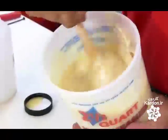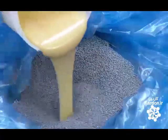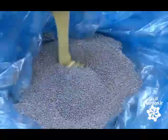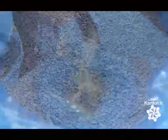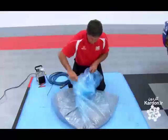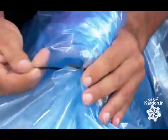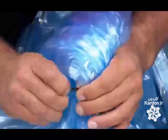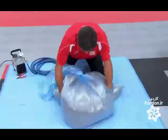To make the seat, they first have to produce a template, which is in itself a two-day process. Technicians prepare, then pour an adhesive into a bag full of foam beads. The adhesive contains resin and a hardener. Once the adhesive seeps in, they squeeze out the air and tie the bag closed. Then they knead the bag to spread the adhesive over all the foam beads inside.